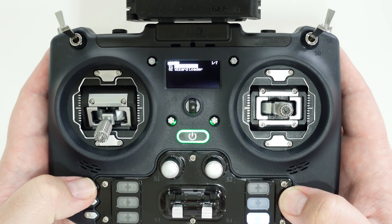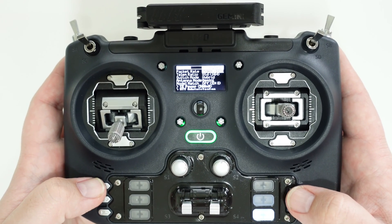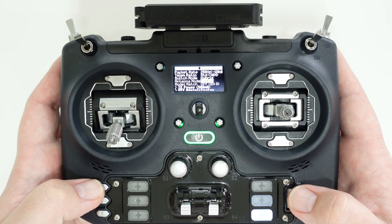Now you have your radio set up and a model. To set up the T20 for Gemini-only receivers, go into the ExpressLRS Lua script and set the antenna mode to Gemini. As long as you're exclusively using Gemini receivers, you're good to go. But if you're using normal receivers and not Gemini ones, go back into the Lua script and set the antenna mode to either antenna one, antenna two, or switch. Switch basically alternates between antenna one and antenna two, so select whichever option suits you.